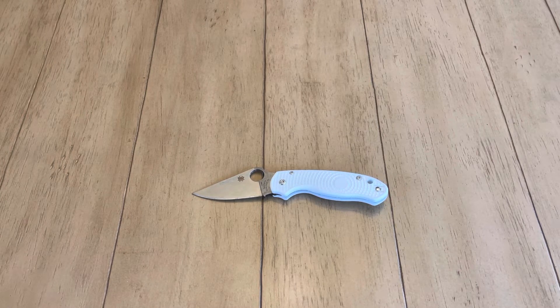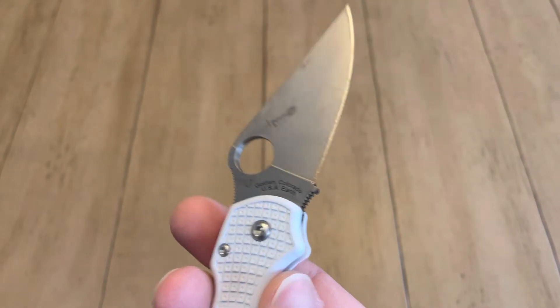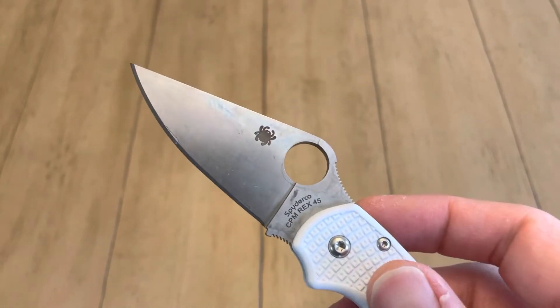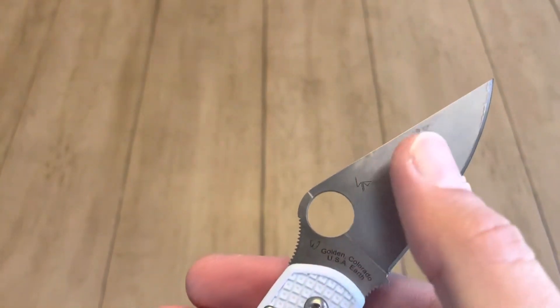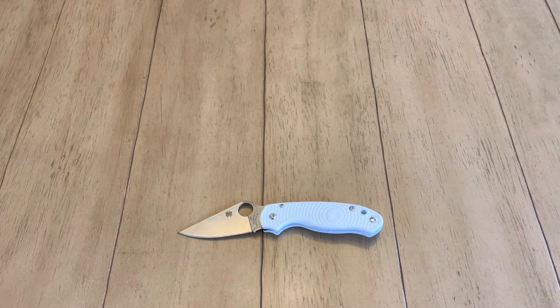So maybe I should back up a little bit. A patina is basically a reaction of the knife's steel with oxygen to form a layer on top of the steel. That's what you see as the patina. Depending on what reaction is occurring, you either get black rust — which you see here, like these spots here — or you get red rust.